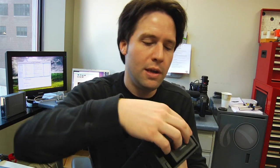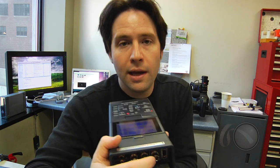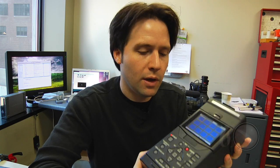First and foremost is the ability to record an HD SDI input. This takes HD SDI 1080i 60i, HD 720 60p, or SD 480i directly into it and records on the device onto the P2 cards in either DV, DVC Pro, DVC Pro HD, AVCI 100, or AVCI 50. These are the highest quality Panasonic codecs, so it's just amazing to have in a small box. Any incoming HD SDI signal recording those codecs makes it a very versatile unit.